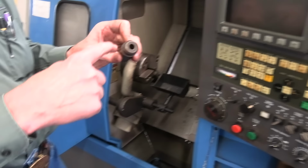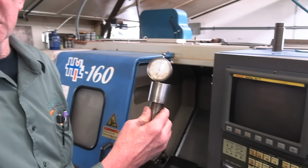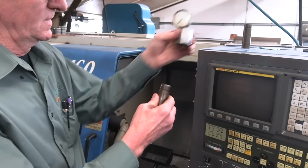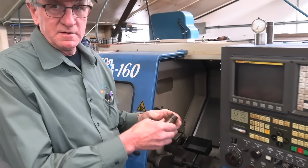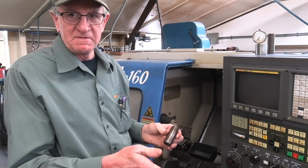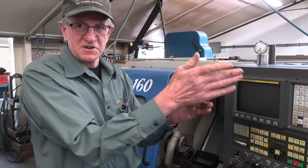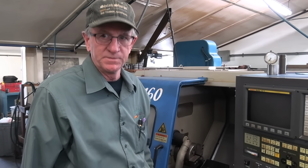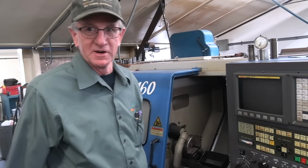Put this machine in quite a few years ago, and this is what machines the knob on the end of the barrel. And we have gauges and we check for the headspace on that. And since we put this machine in, you can make a barrel today and take a rifle that was made 25 years ago and screw the barrel on, and all your sights and stuff will index up on top. Winchester always did that with their lever guns. That always amazed me, so we're doing it.